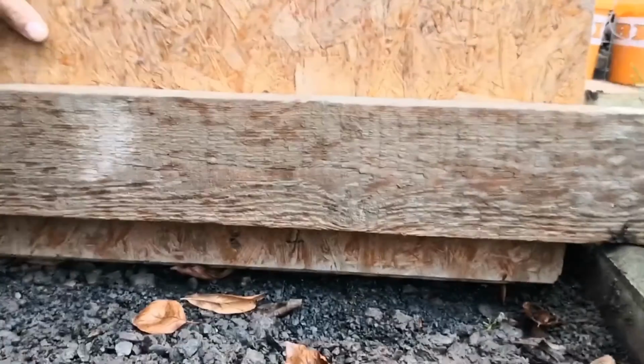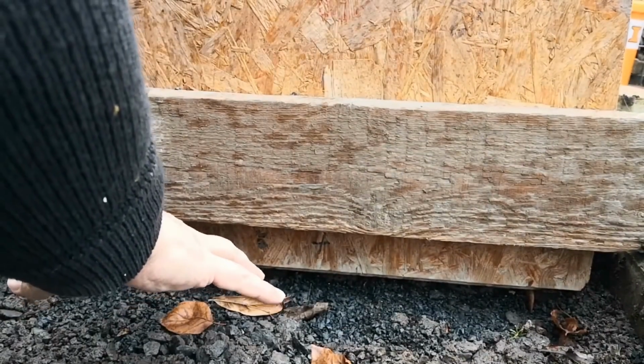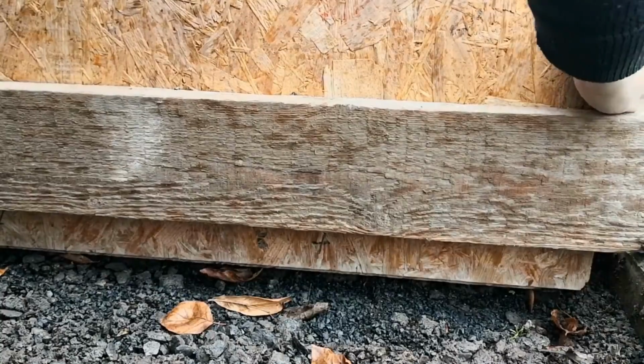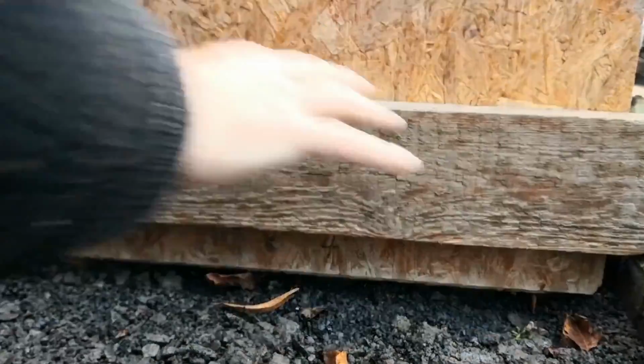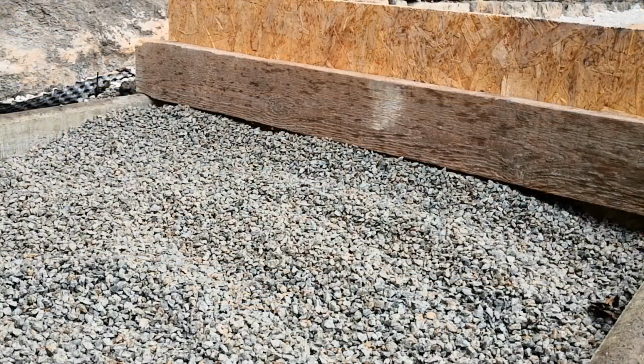I place the board at the edge of the sidewalk. Then, the laying gravel will be filled in front of the board. After that, I can level the area with the board and have an even laying surface. The paving stones are simply laid on top of these. I have just now prepared that.